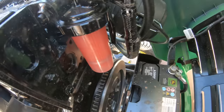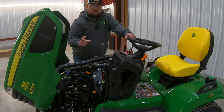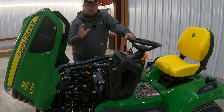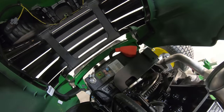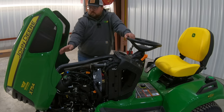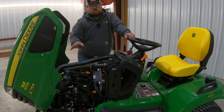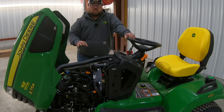When looking for our fuel filter, that's going to be right here at the front of the engine, and this is going to be a water separator fuel filter. You will have that bowl-style filter where you screw off the bowl and change out the actual filter inside. In front of that is going to be our battery right down here at the front of the machine. It looks like the hood would get in the way, but you can easily remove the hood on these machines to service everything on this engine.